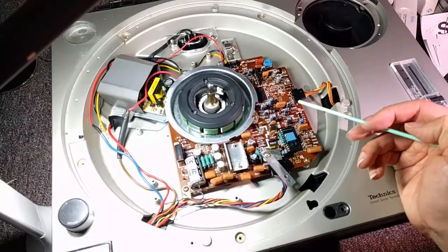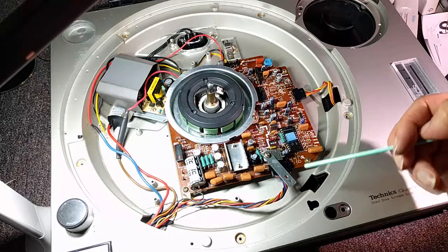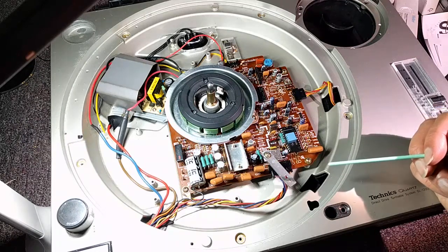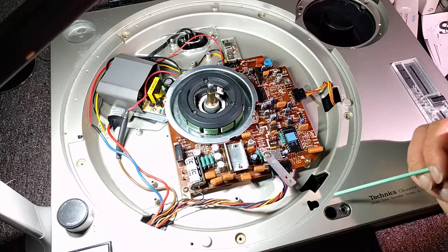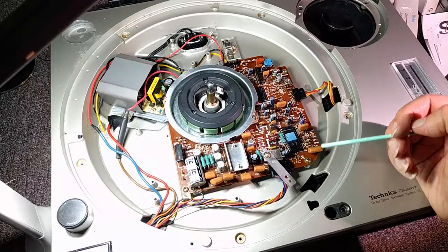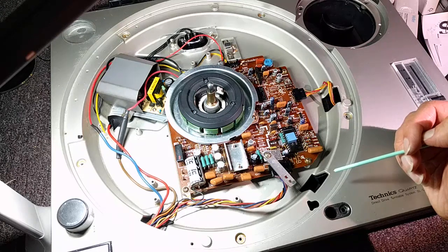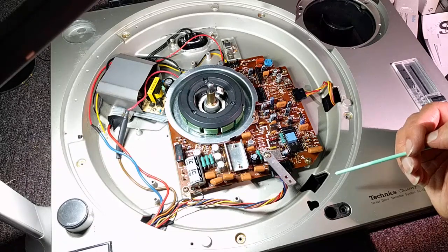Why is the LED thing giving me some hassle? The wires have to be really, really thin. When you depress it and release it and it comes back up, it's really finicky because of the very tight space. I also need to make a little board for the LEDs — the 3201s or whatever they are. I found the white plastic, and I do have the screw and the silver mount in a bag. I'll probably use 30-gauge wire — I was wanting to use my new 22-gauge power wire but it might just be too thick. Stock lamps are really hard to source now, so I might have to stick with these LEDs. They're warm LEDs, so they should look pretty nice, pretty similar to stock.